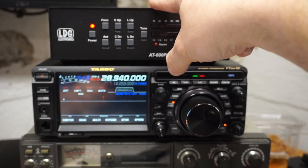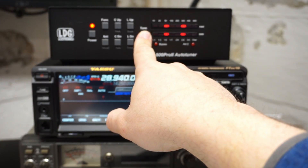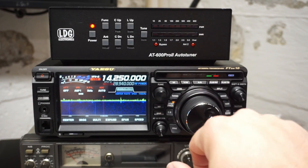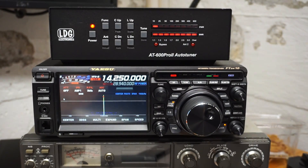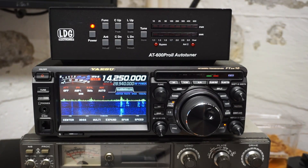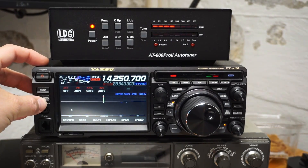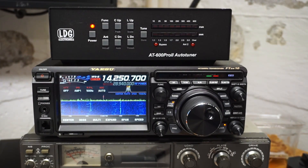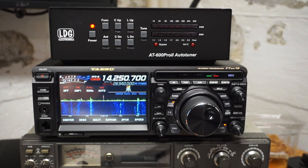That said, I can use the tune button on the tuner itself — a long press does a full tune, or a short press does a memory tune. I'll do a long press here. It tuned pretty quickly; I guess it was already relatively close. Let me switch over to 20 meters and do the same thing. It looks like it got a match, and switching to a constant carrier mode confirms we do indeed have a good match. So it seems to work just fine using the button on the tuner, but the tune button on the rig itself does not work.